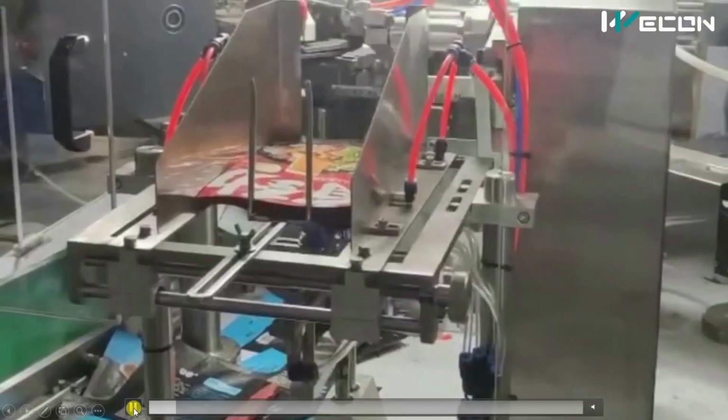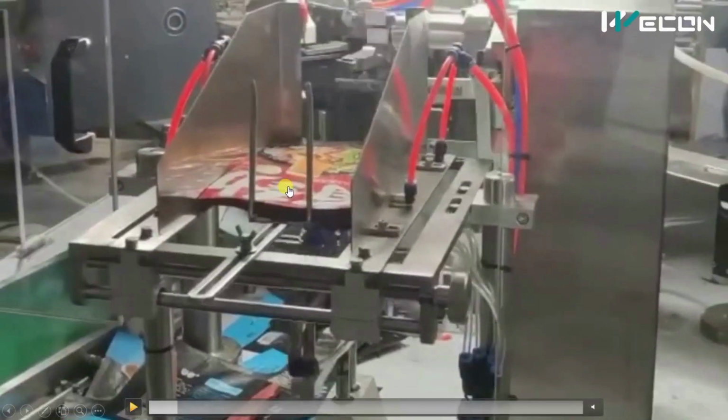Here you can see prefabricated bags are put into the machine. Here the cylinder rises, and by creating vacuum, it will pick one bag and come down again. After that, observe this assembly. There are two arms. One is this arm, that is used for coming backward and going forward, and another is this arm, that is rotating, picking the bag and giving it to the turntable. So carefully observe these two things.